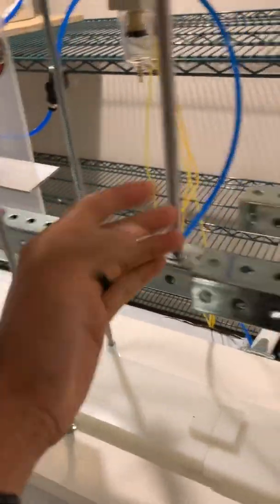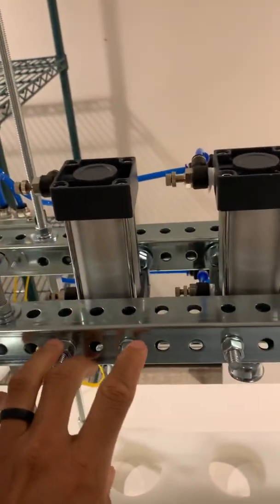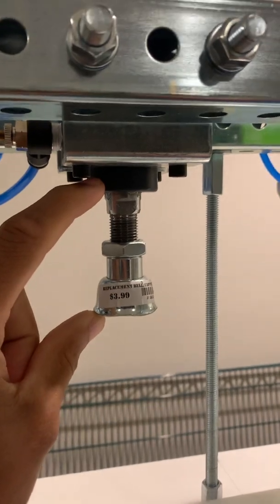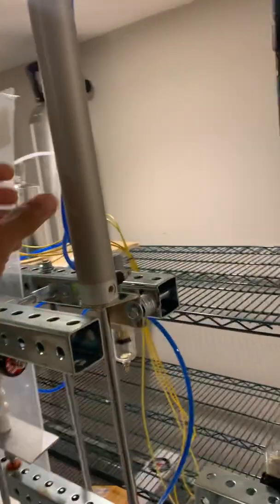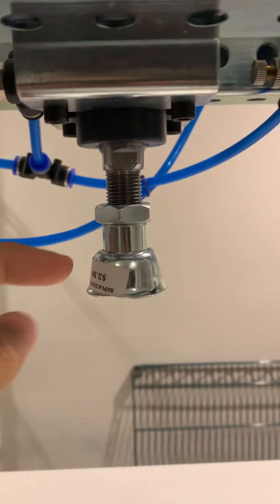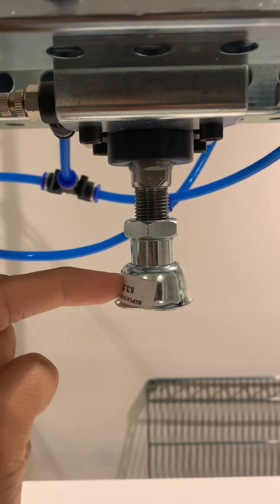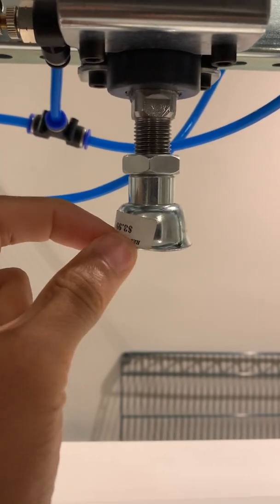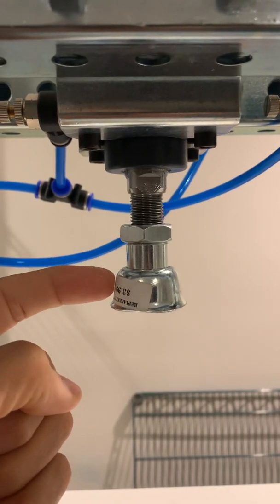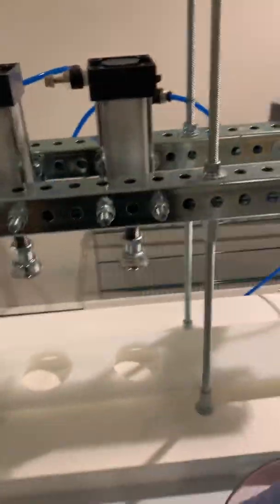Moving over to capping — it's very similar, except instead of moving a square tube up and down, this frame holds air cylinders with a shorter stroke, only about two inches, because that's all I need them to move. They're much stronger — I think these are two-inch diameter cylinders, quite beefy compared to the skinny one-inch ones on the filling side. This is the capping component, and I had to match the thread to it. I bought them from a brewing company for $3.99 each. A lot of this was mating different parts together so I didn't have to do any welding or brazing.